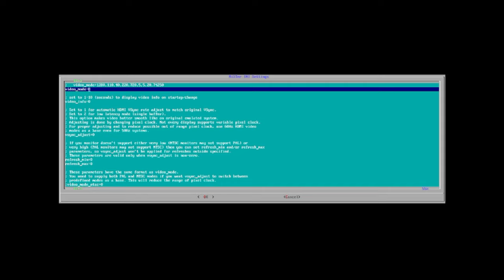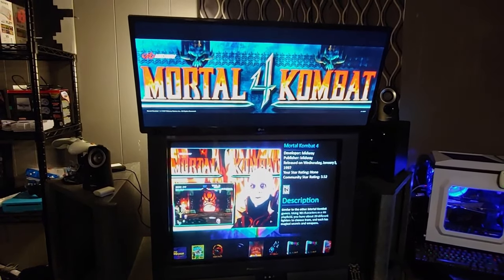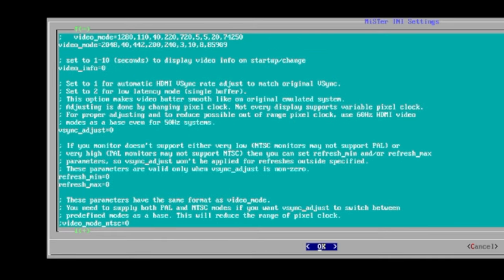It's basically doing the same thing, except this will give us a true 240p image with thick scan lines and 120Hz refresh that is going to make those phosphors glow. Credit to Ban Yuki and Mike Chi for this scan line mode. I had been putting this off for ages because I figured I'd have to set a custom scan mode for each individual core, like I had to back in the day with RetroArch running an emulation PC to a 15 kHz TV through a CRT emu driver, an AMD video card, a transcoder, and a whole lot of pain. But here on the MiSTer, it was fairly easy to set up — one custom mode line and no issues.